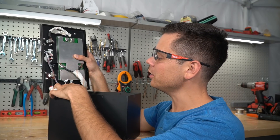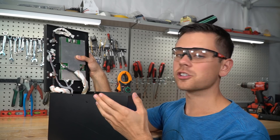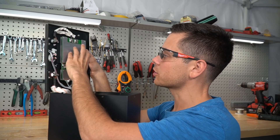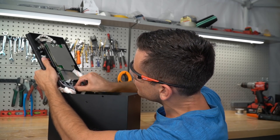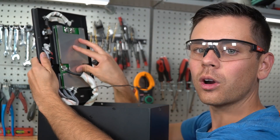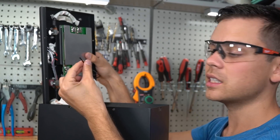I think I just found something. The balance cable only has five wires, and that's typical for a 4S lithium iron phosphate battery. But there is supposed to be low temp charging protection, and that sensor should exist only on the cells — typically we would have two more leads coming from the BMS, but I cannot seem to find them. If the low temp charging protection sensor is only on the BMS, that would not be good. I found it — they just folded it up and glued it inside. Look at the excess lead length. This is supposed to be attached to the cells. Why is it attached up here? That doesn't make any sense. This is going to get warm when you charge and discharge, so it will give you an inaccurate reading of the cell's temperature. But it says that it does have low temp charging protection, so let's put this in some ice cold water and see if it actually works.